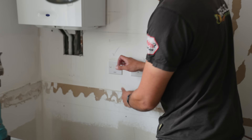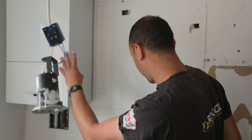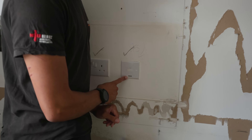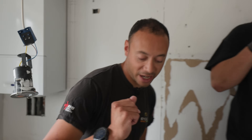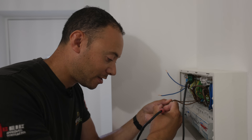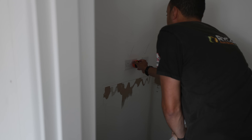We're getting about 20 megohms — it's an acceptable reading, however on a fairly new building I'd expect it to be a lot higher. I'm going to have a look around and see if something's still plugged in. We've got the boiler here — this could be on its own radial circuit. I'm going to turn it off anyway, as that disconnects the live and neutral and would give a false reading. We've also got the garage connected here off a spare, which is quite unusual. Let's test again and see if it's cleared up — nope, it remains the same.